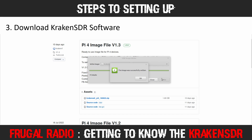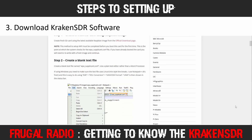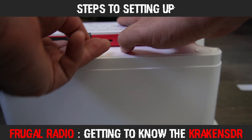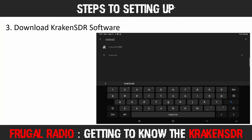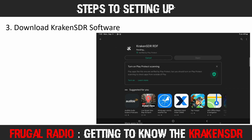Once that completed, I created a WPA supplicant configuration file and wrote it to the SD card. This enables the Pi to connect to my phone hotspot rather than generate its own Wi-Fi, meaning all devices have full internet access. The SD card was then popped back into the Pi 400, making it ready to boot. The next piece of software required was the Kraken SDR application — I use Android, so downloaded it directly from the Google Play Store. There's a link in the description below.